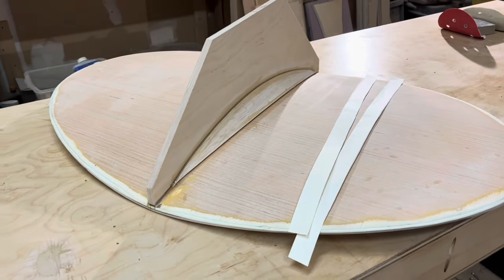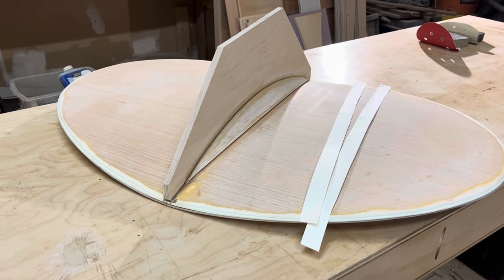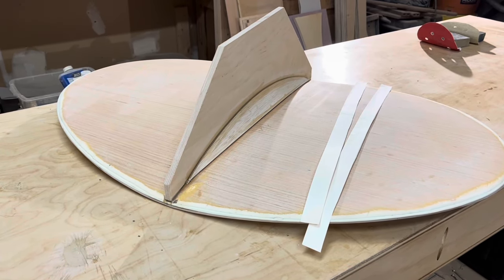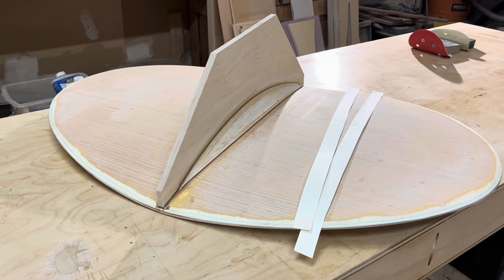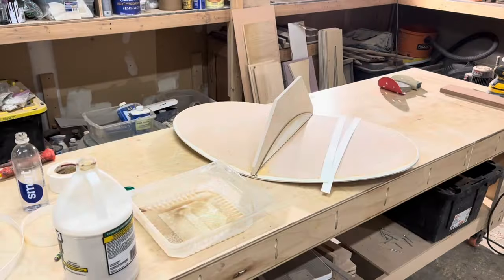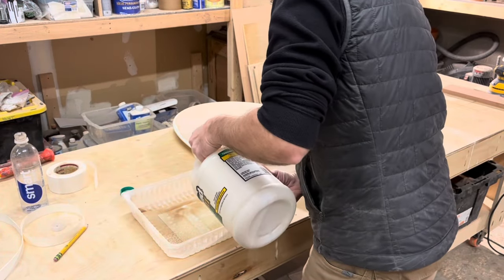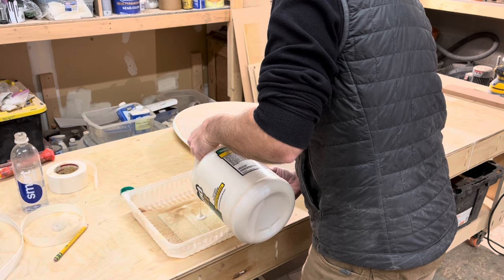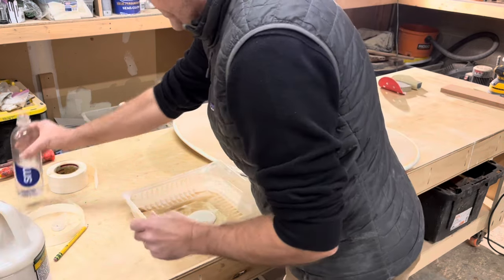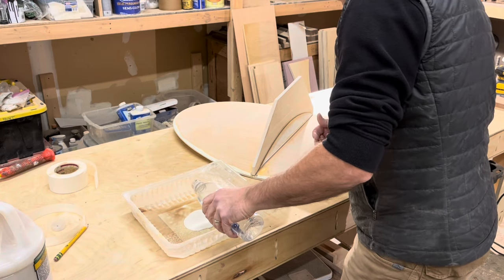The way I look at it, adding paper is almost like welding wood together — paper is actually wood in strip and sheet form. I start with Titebond III, pour it in a big tray, and add a dash of water, about 10 percent.